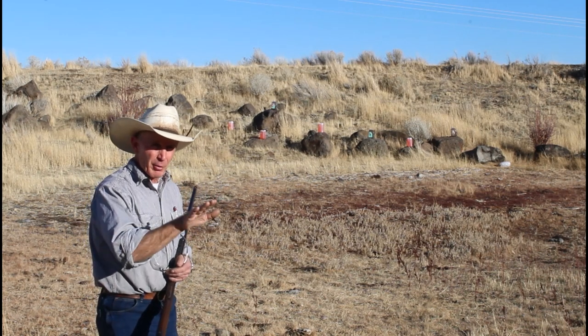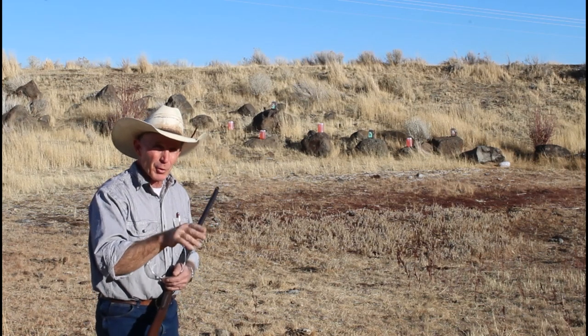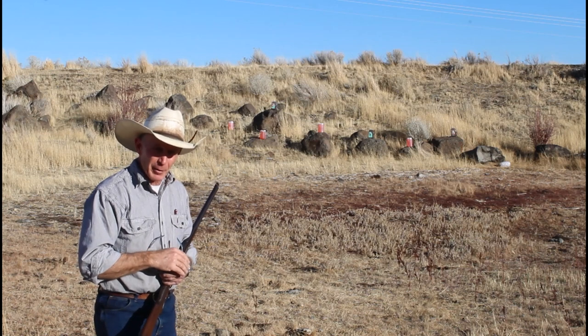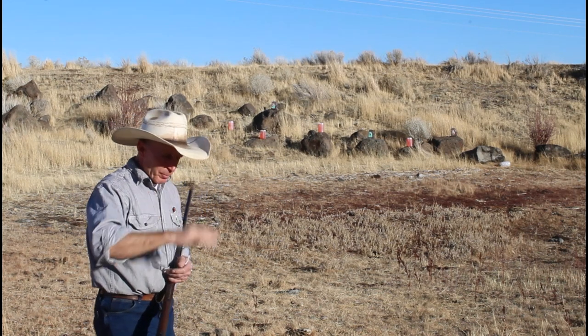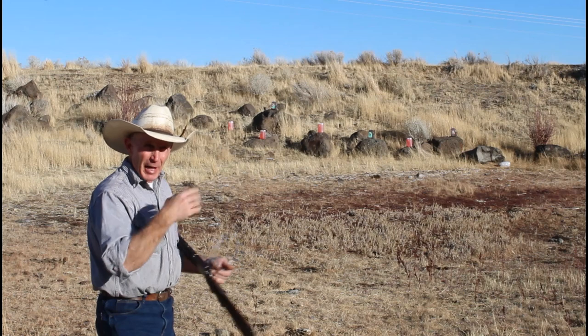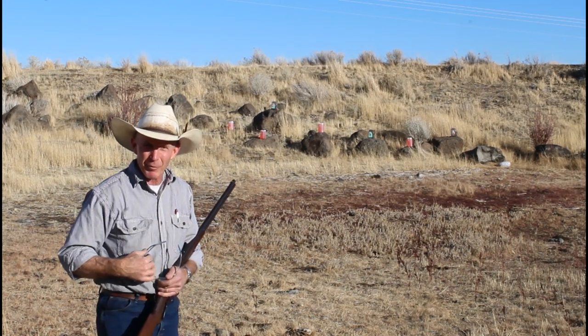If there's scratches going across grain, then it's really easy to pick those up and see that you haven't got them all the way out. So we alternate 90 degrees on each grit as we get a little finer. And then we always make sure that the last pass or the last grit is perpendicular to the action, in this direction, lengthwise, because that's how they were finished from the factory. So anything that shows is going to show just like it did from the factory.